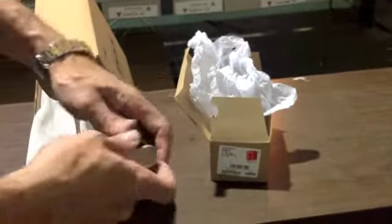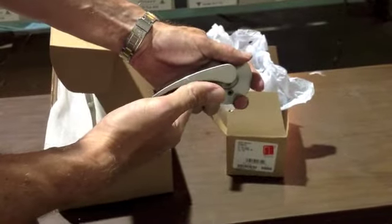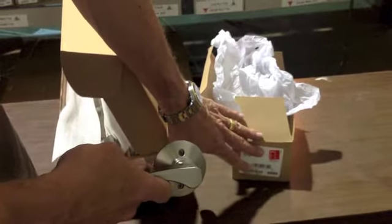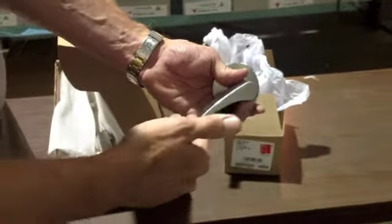They're handed to the door — they're not handed to the lever. If you notice this lever, you would say normally that's a left-handed lever, but it's in a right-handed box, and this is because this is for a right-handed door. Doors are handed from the outside looking at the door, and it's the side that's hinged on. So even though this looks like a left-handed lever, it would be on the inside of a right-handed door.